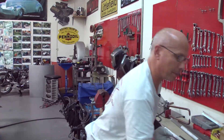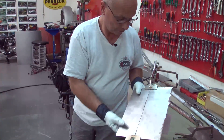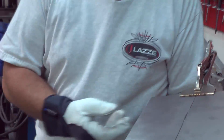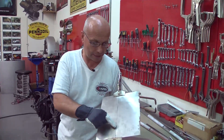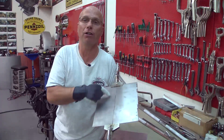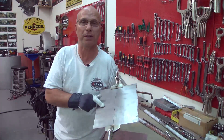This is what I recommend. Now I'm going to show you a piece that is not good preparation. On this piece you can see there's a gap, then tight, a little less gap, tight, bigger gap, and tight. If you think this would be acceptable preparation, it's not. When you have alternating gaps and tight spots and you weld it together, it's going to shrink differently throughout, and you're going to end up with lots of distortion on the panel. This is a bad foundation to start with.